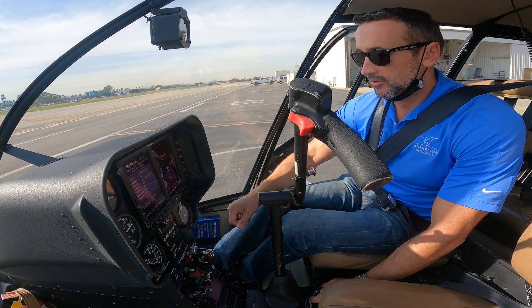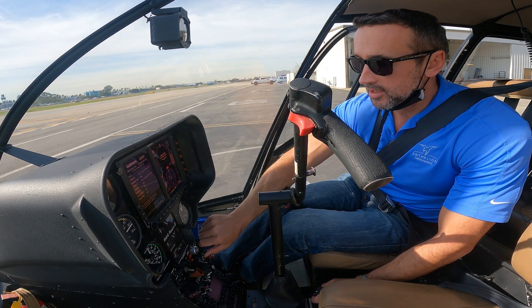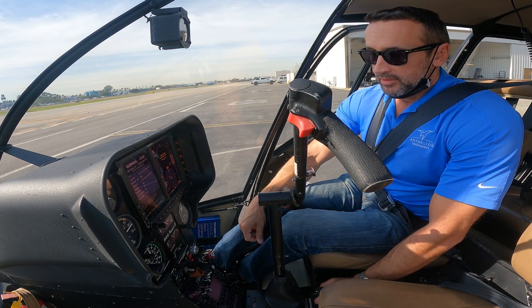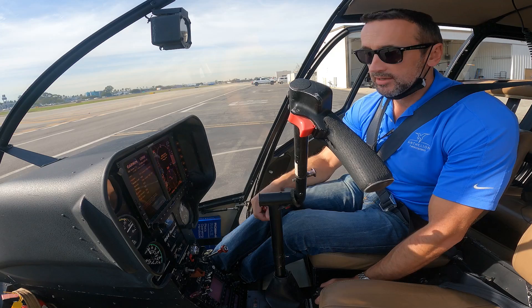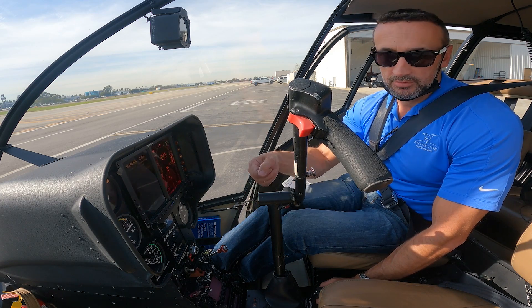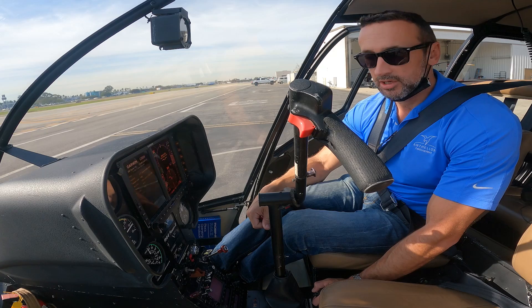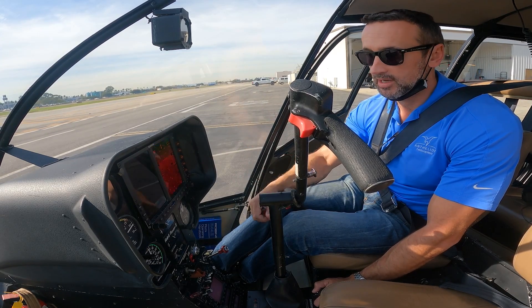Mixture full rich — push it in fully. Since this is a fuel-injected aircraft, we need to prime it first. Keep hold of the guard — easy thing to lose. Now go over the key to prime and hold it for about eight seconds: one one-thousand, two one-thousand... up to eight one-thousand. This varies for warm versus cold aircraft; for a cold aircraft, a solid eight seconds works. Then pull the mixture back out — we should have enough fuel primed to get the engine started. Once it catches, we'll push the mixture in quickly to keep it running.